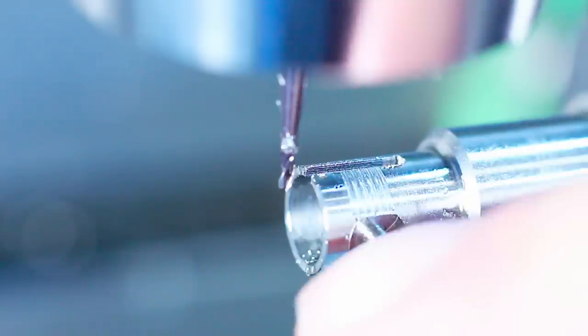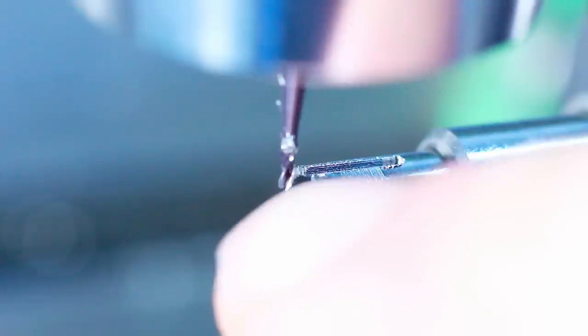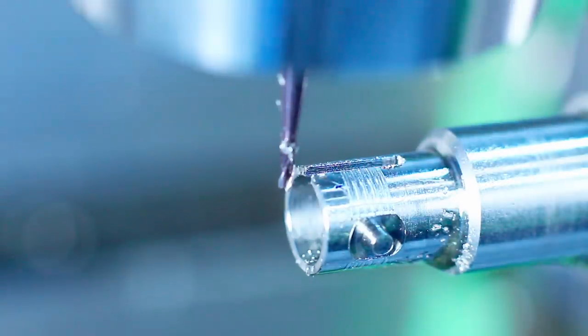This technique of dropping the cutter below the area that has been used for roughing is also very useful on CNC mills. That way you can get a lot more life out of your end mills. And since end mills are a fairly expensive cutting tool, well, we like to press as much utility out of them as possible.